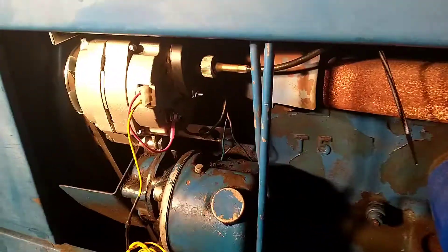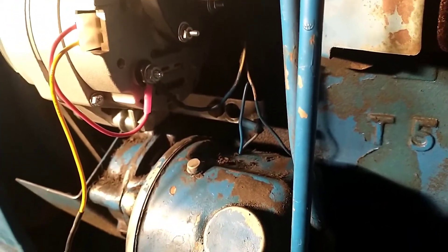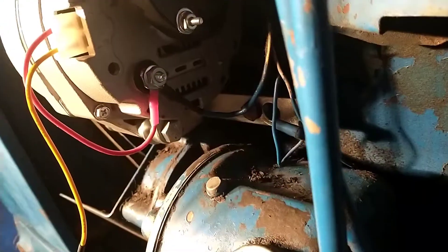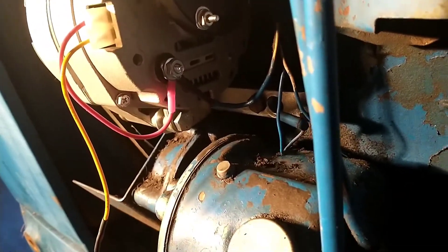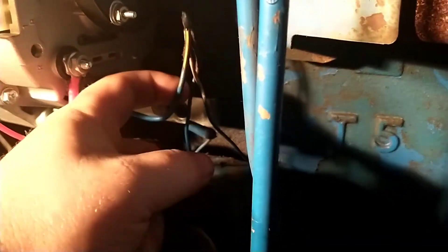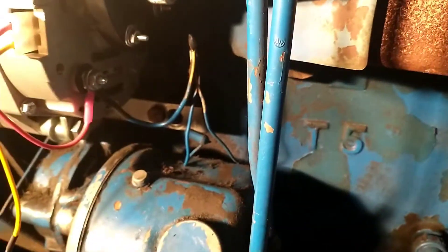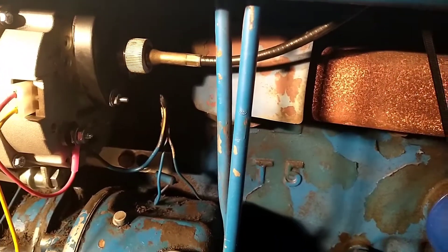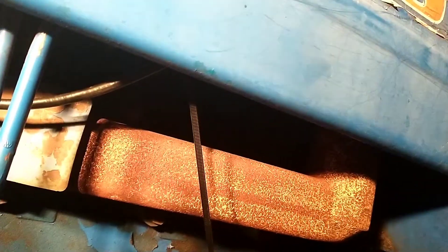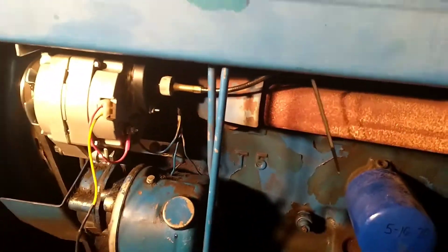We plugged it in and hooked this red wire back to the battery charging post, which excites the alternator and gets it charging, and then we crimped on a ring connector and ended up crimping it, then soldering it, and also putting some shrink wrap tubing on. That's the battery charging cable on this tractor — it's brown with a yellow stripe, just in case you're working on one. The TAC is going to hook up fine. One thing I did have to watch was to keep it out of the exhaust manifold, so I've got a zip tie holding it over against one of those hydraulic tubes.